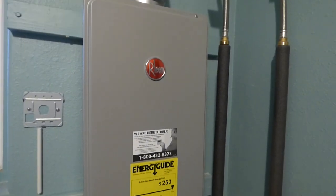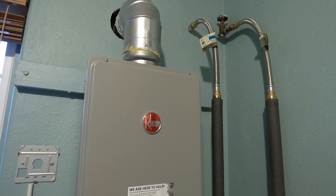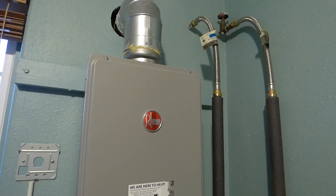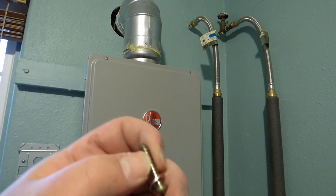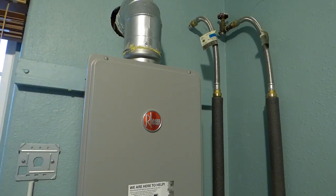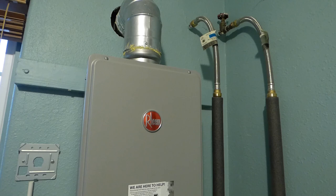I've got four of those screws in there, and an important note here on those screws — anyone that's done a lot of DIY work should know that some of these light screws can be cheap. A little strippy daddy — and this is after even drilling pilot holes. I actually put it up there, marked out some areas, pulled it down, did some pilot holes, and then tried sinking this in. They got all in there, but go ahead and use some of those self-tapping screws — those are nice.